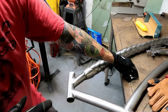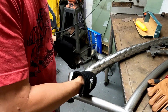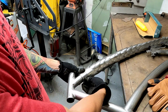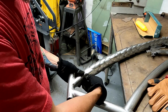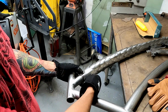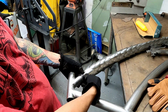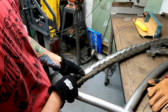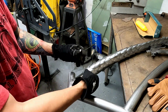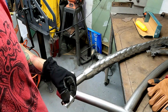Alright guys, so we're at the end of all the scales. They're finally done. So what I'm going to do is we're going to give this a try. I'm going to take these collars here, and they're going to get wrapped around the spoons to almost act like a neck collar. I'm going to have to do some adjusting here because the way the spoons lay, it's going to kind of sit like that. Now I've got this big gap. I think what I can do is probably throw a filler piece in there, but I need it to be able to go all the way around. So if I tack it here, I think I can hammer it around and get what I'm looking for, and then just grab some pieces that I can make a triangle and make them fit right in there. That should work just fine.